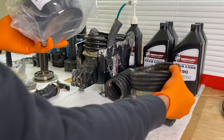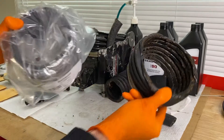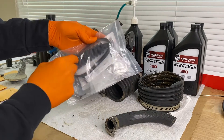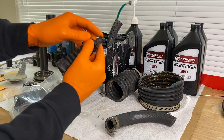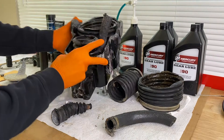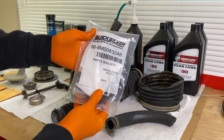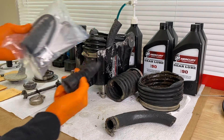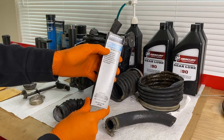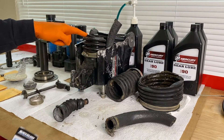Here's the old U-joint bellow compared to the new one. Very, very greasy inside — the new one will not have that grease inside. Next, our shift cable bellow: new clamp, new bellow, and a new securing clamp — a little lock ring that secures this portion of the bellow to the shift cable on the inner housing. We've also got a couple of O-rings that go on the opposite end of the bell housing. Old versus new. And your bellow adhesive — extremely important. Part numbers are down below in the description section along with a link on where to purchase. This is a must-have when doing a bellow replacement.